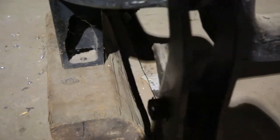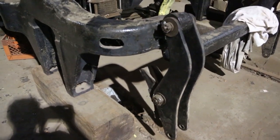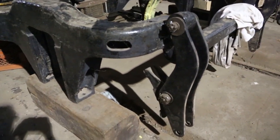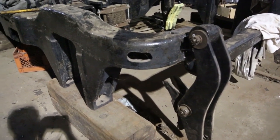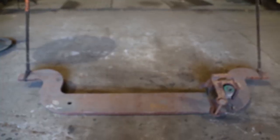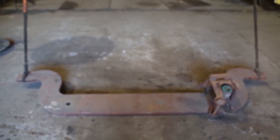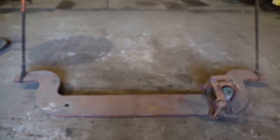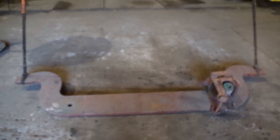Once we get the truck assembled, one of the things we do is hook up the brake straps. And one of the maintenance issues is anytime you change a traction motor or change a wheel, you've got to disconnect all those brake straps and get them out of the way before you can drop the traction motor down. We built the equalizer assemblies long before I even had any thoughts about making a video. So this is a little bit of a mock-up using one extra equalizer bar that we happen to have. A little bit of explanation about how these things work.